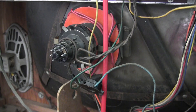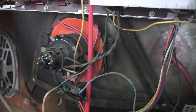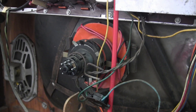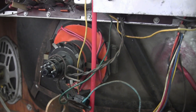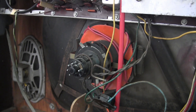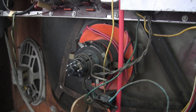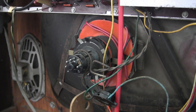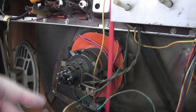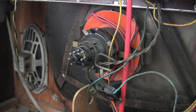Usually you either want to ground it or put it at the same voltage as G2, which would be around 400 volts, and usually there's not much change in between. I recently saw somebody working on a set that had electrostatic focus with a control, and I asked if going from zero to 400 volts gives a smooth change in focus like you get with magnetic focus. The consensus from the few folks who had seen one was that there's not quite that much change. So I think that's why you can get away with just shorting the pins — saves cost, no wire to run, no control or switch needed.